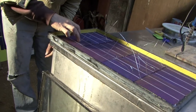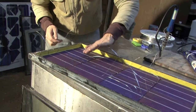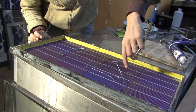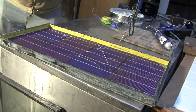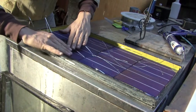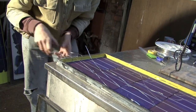Just be careful when you're pushing down here — if you crack it a tiny bit, don't worry too much. Starting here, these tops are going to go onto that. Then these wires here are going to go onto that. The wires coming off the bottom of this one are going to go down onto the top of that, and these wires coming off the bottom of this one are going to connect to the top of that. Continuing: the wires off the bottom of each cell connect to the top of the next, all the way down. These wires here at the end are going to be the positive terminal for the panel and will run off into a wire.